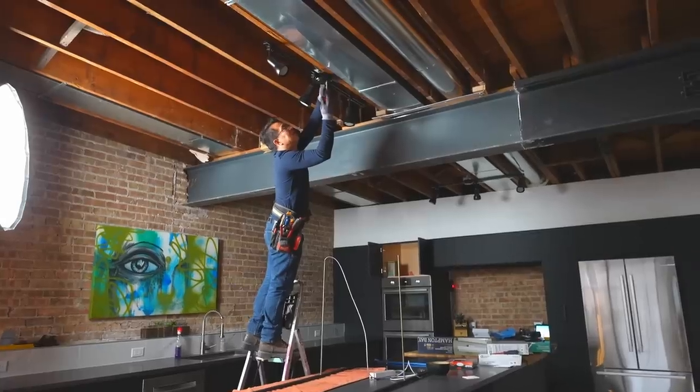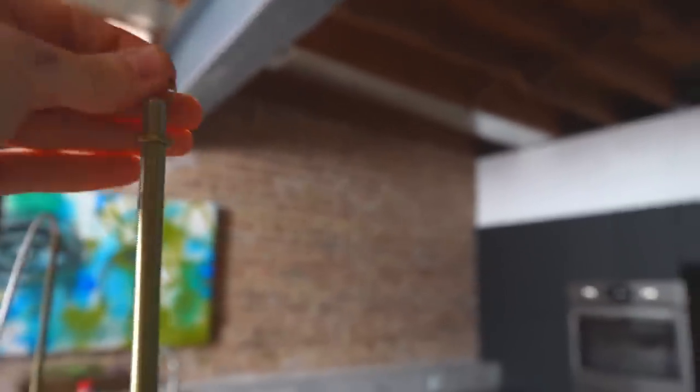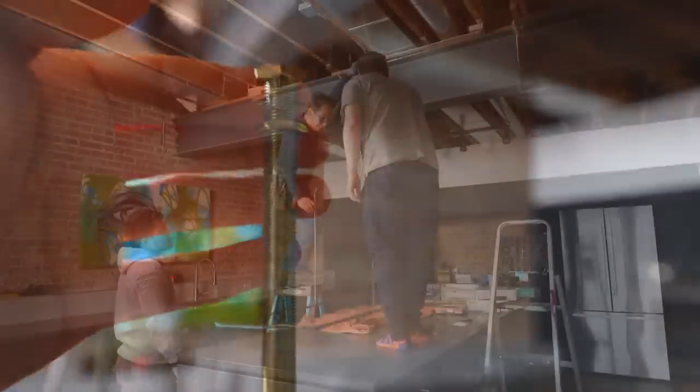It was bright and early on a Monday morning, the electricians just got here, and we're going to go hang this pendant light up. I'm pretty excited to see how it looks when we fire it up over the island. We've got one nut on each threaded rod to set the height on the underside of the flat bar, then we'll drop on a lock washer and a second nut on top of the flat bar to lock in the fixture.